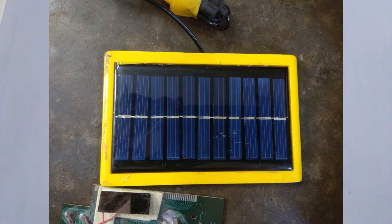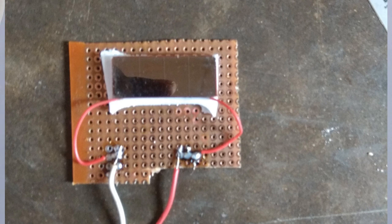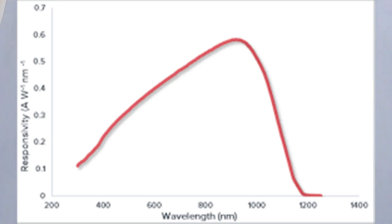Right now I don't have thermocouples or a thermopile. What I have is a solar cell acquired from a calculator — also a normal solar cell. I got the small solar cell which is used to charge the battery of the calculator. A solar cell is sensitive in the visible region, and because my 532 nanometer green laser is in the visible range, I am using it. When light shines on this solar cell it will generate electricity, and I will plot the amount of electricity produced versus time — that will give my result.